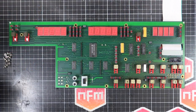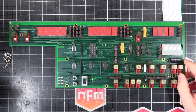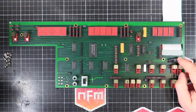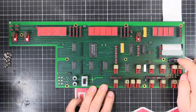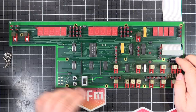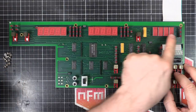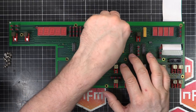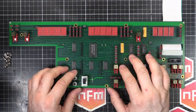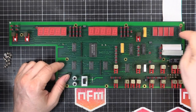While waiting for parts to arrive I pulled the front board out for a clean. I found another sneaky capacitor — a 1000 microfarad 6.3 volt axial, United Chemicon SM series, standard 85-degree rating — so I'll need to get another one to replace it. One interesting thing: all the LED displays across the top are socketed, so if one goes faulty you just pull it out and pop a new one in. That also means you could change the display colour if you wanted — blue, white, whatever.